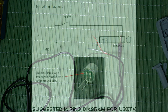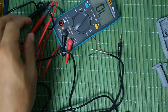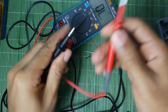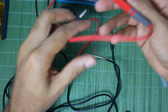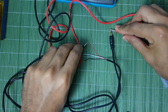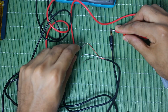I have stripped my wire here and I'm going to show you a way that you can find which wire is which for this connection. Here I have my multimeter. It has a function that if you go to resistance and then go to beeping, if you touch the connections it will tell you which connection is tied to which. I'm going to test the first one, which is supposed to be connected to the positive of the microphone. Yeah, so we know that is this one. You can also make sure that it's not tied to other connections — no, no, yes.